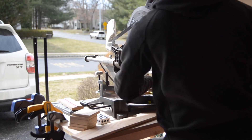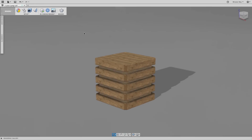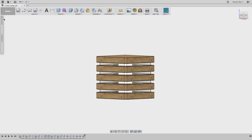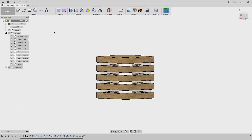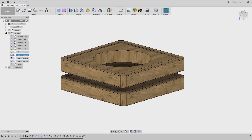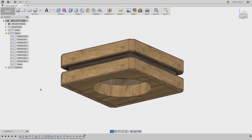I don't have a drill press, so there is that. My vision was to make a stacked wood and acrylic light with a sort of tiered look, kinda like a Japanese pagoda, and with subtle chamfers to give the geometry a little more character. And because I'm using a CNC, I can also carve features into my layers to help with alignment. The lid and base would be designed to accommodate a 1-inch dowel, around which I would wrap an LED strip. I would figure out the routing of power cables on the fly later.